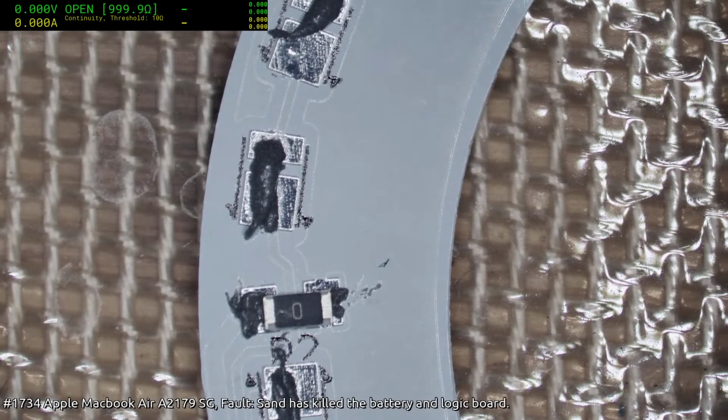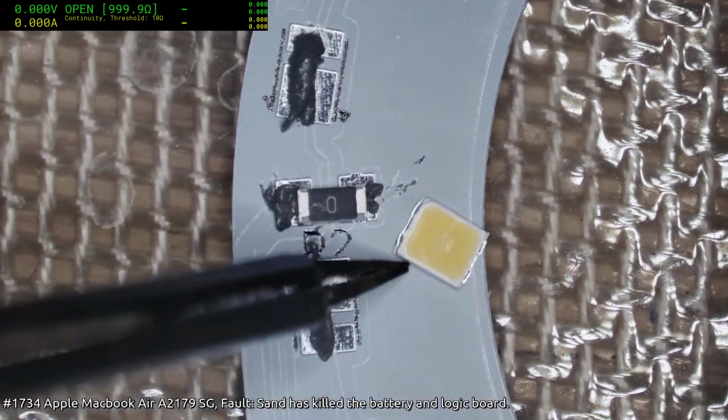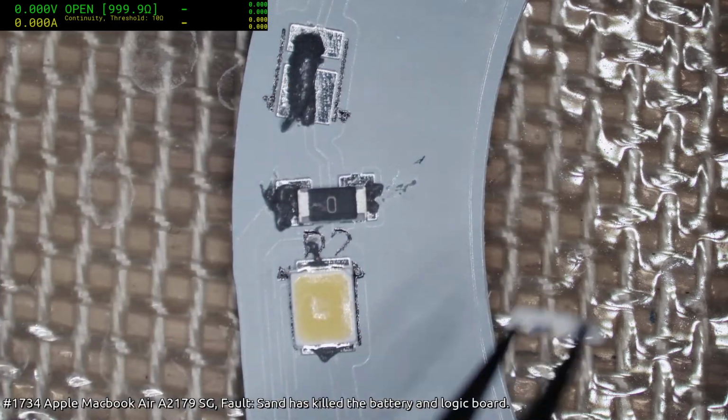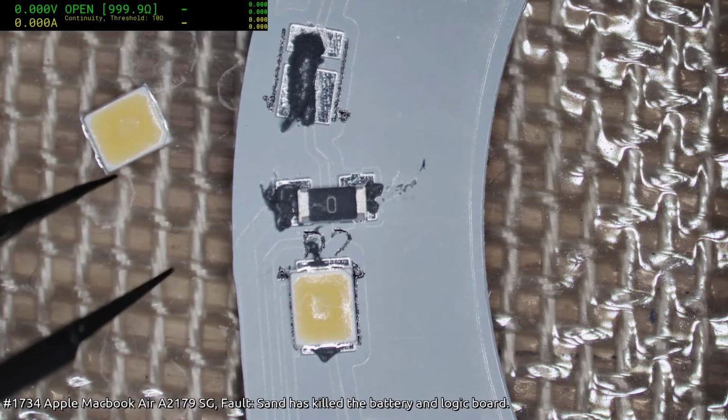I'm really not bothered about trying to make it nice or anything at this point, because like I said, this is a one-off build, and after this I'm just going to go stencils. And when you go stencil, then you do want your paste to be like this, because if it's too liquid, it's just going to go everywhere, and it's not going to hold its corners and things like that. So I guess you could say I'm not bothering with those little steps, simply because it's just not going to matter at this point, beyond this one job. I'll tell you what it is, I wish I had my vacuum pencil with me. It'd be easier to flip these bastards over.